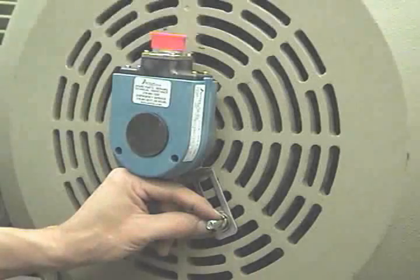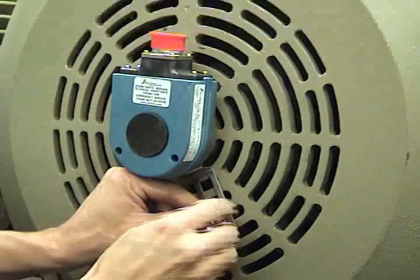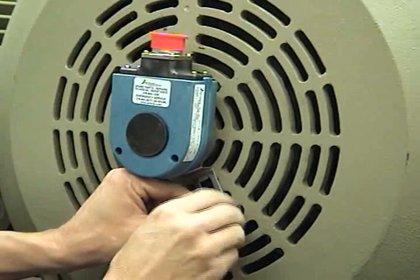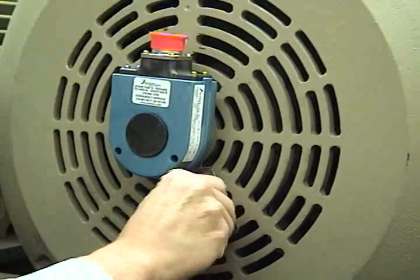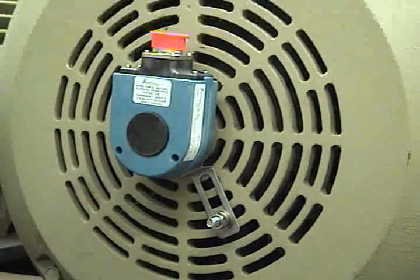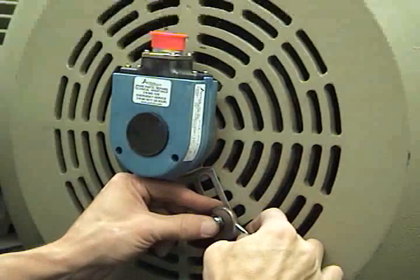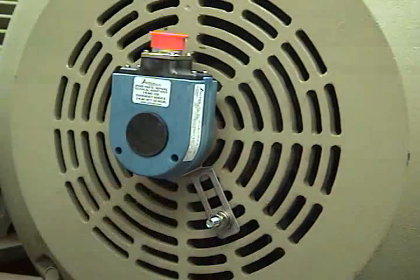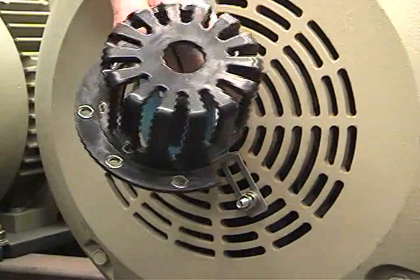Secure the free end of the HS35M anti-rotation bracket to the frame using the T-bolt, washers, lock washers, and nut provided. Use additional washers as needed to install the bracket without a large deflection or bend. Turn the shaft by hand and verify that it turns freely and does not produce excessive run-out or wobble of the encoder.